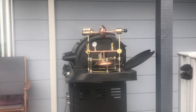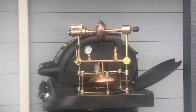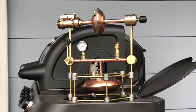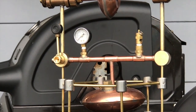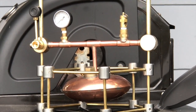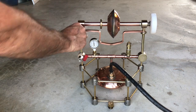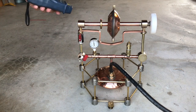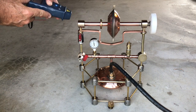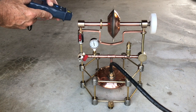With the whole machine assembled and placed on the barbecue, I can use the gas flame to boil the water in the boiler. The steam goes up the vertical shaft in the middle to the horizontal shaft — a kind of manifold — through a valve and up to the top, and should come out the jets to make it spin around. Unfortunately that design with ball bearing races didn't work because they're sealed ball bearings with plastic sleeves that seal the steam in, creating too much friction.